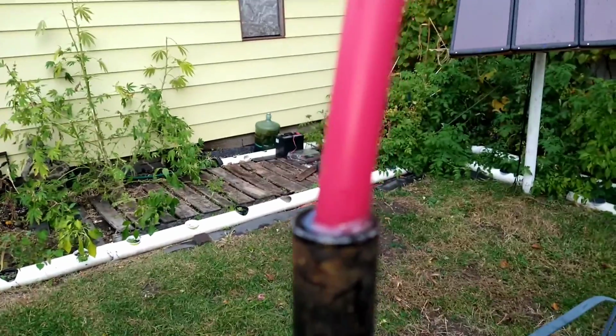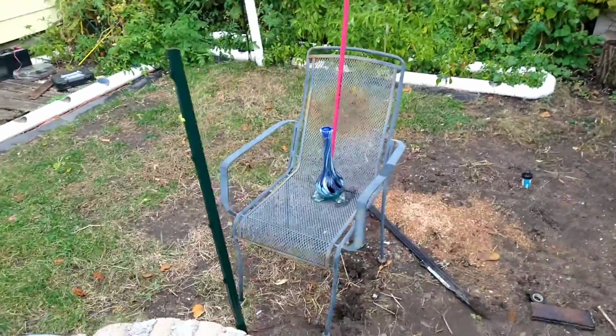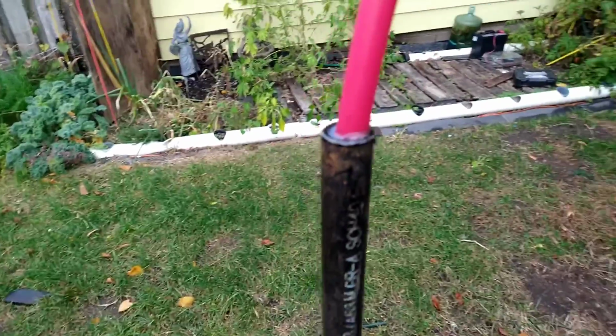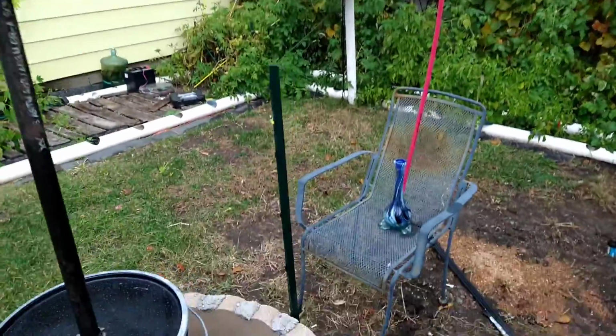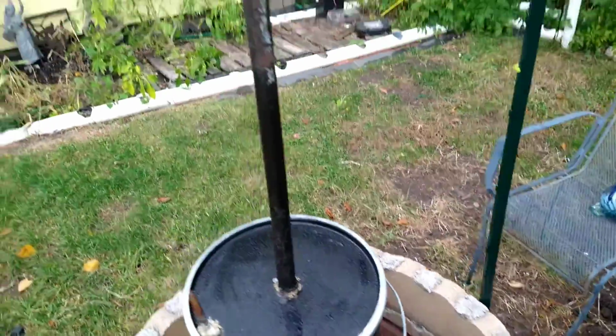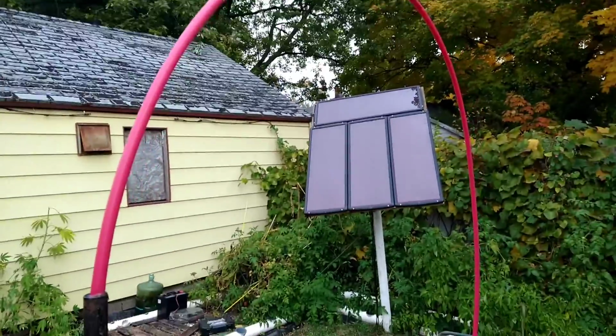I'm gonna find out how low temperature if this PEX fails or survives, and all there is electrical tape with the Gorilla Glue 5-minute epoxy. So they both have a temperature rating of around 180. So see if it melts or what happens. If it does, we just pop it off there and do some other experiment that I want to do.